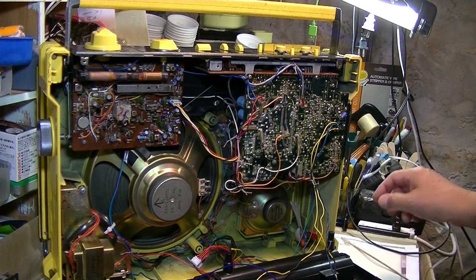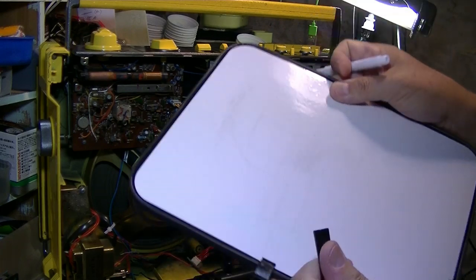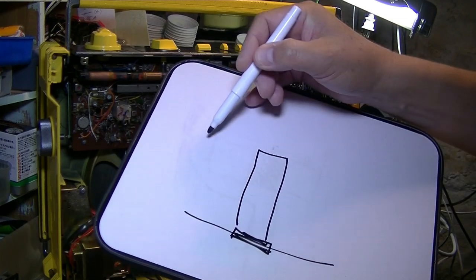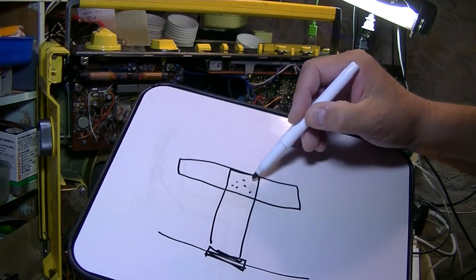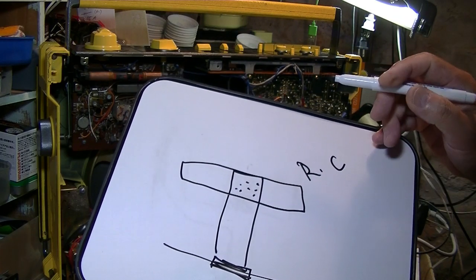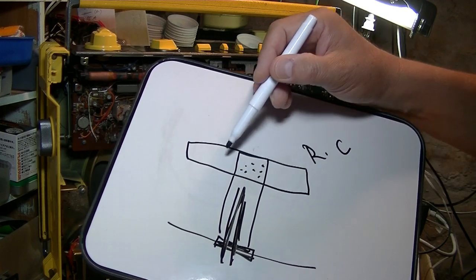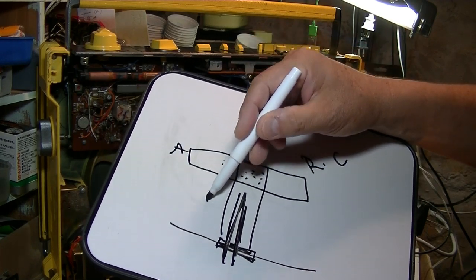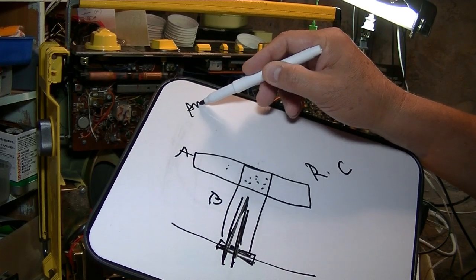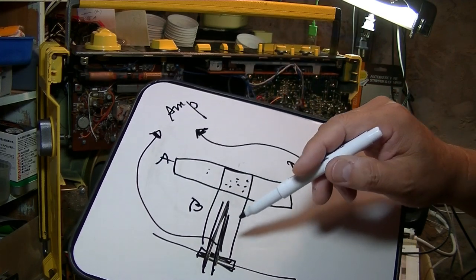And how it works is, once the jack is inserted into the AUX port. Okay, this is the 3.5 jack, and here is a panel like this, and also another panel like this. Here they're touching each other, and at this condition, radio or cassette will play. But once you put the 3.5 jack in here, this touching panel, this is A, this is B, we separate it, and after it's separated, only the outside music goes into the amp. This is normal, and this is when using the line in.